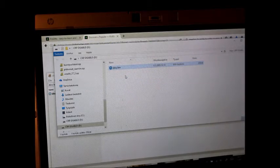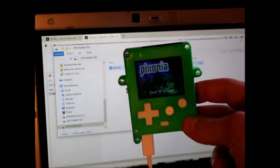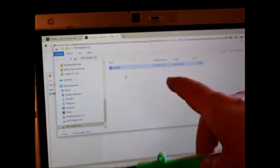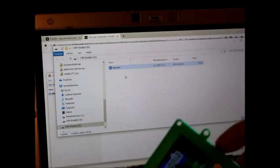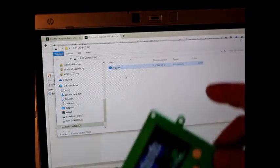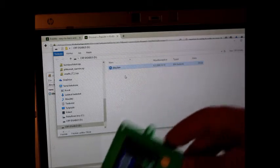So in contrast to some other devices, the NXP LPC11U68 that I'm using in the Pokitto is really cool and friendly towards users, because the USB connectivity, this flash drive thing, is built into the ROM of the chip. And that means two things. First of all, you can never get your Pokitto into a situation that you cannot recover, because you can always just press the buttons and you will be able to access it as a flash drive. So instead of working with bootloaders and stuff like that, if it's not working, just reset it as a flash drive, replace the firmware, and you're good to go.